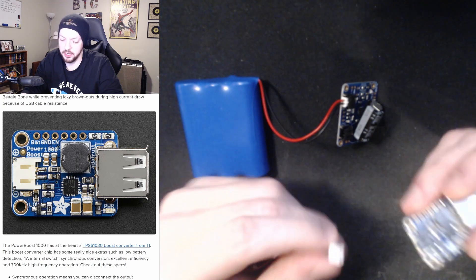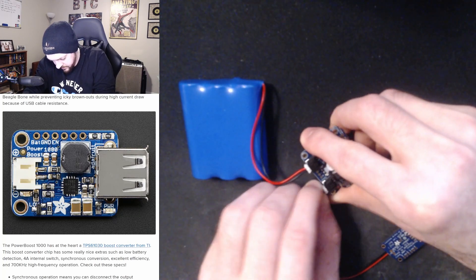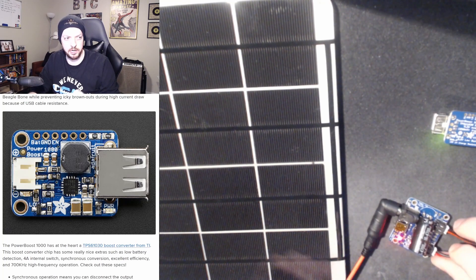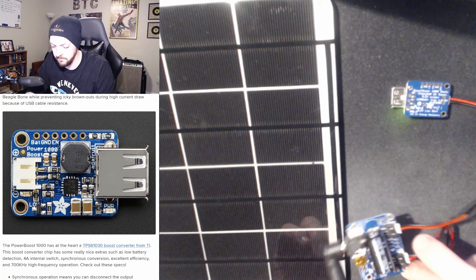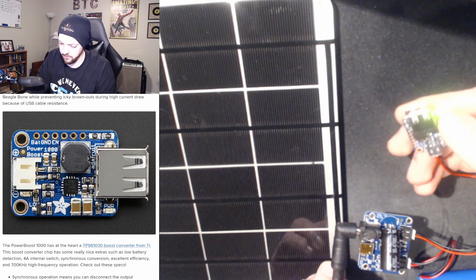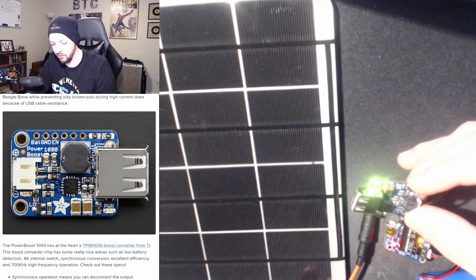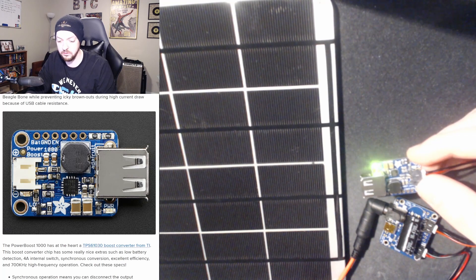Now that I have my USB booster put together, I should be able to connect everything. I turned on a pretty bright desk lamp to get some light shining on the solar panel to make sure everything's working. On the charger, the blinking power button shows it's getting power, the yellow light says it's charging the battery, and the green LED says the USB port has power. So I should be able to plug something into this USB port and pull power from both the battery and the solar panel. My next step is to set up my Raspberry Pi Zero and test it out.